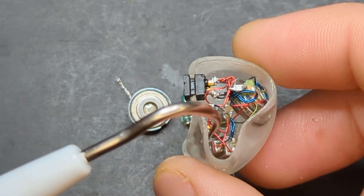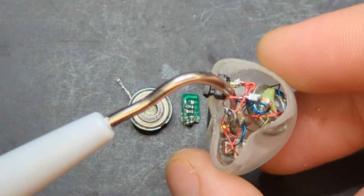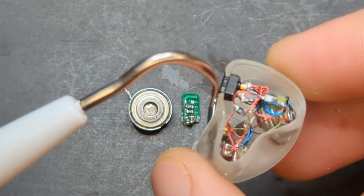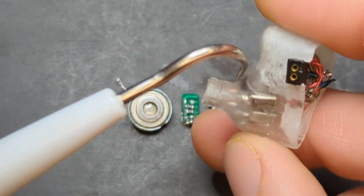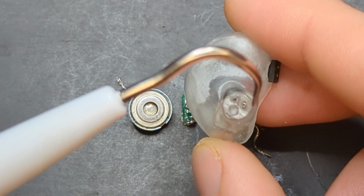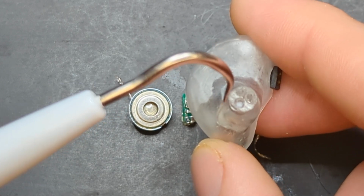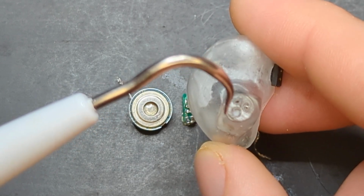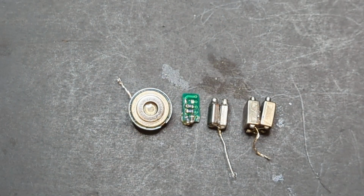All the rest are e-audio. And the reason why is because with the Knowles, there's just no competition. There's no replacement for the treble that these do. And you can even see I'm using no dampening, so there's no dampener for the treble. Only dampening is being done on the mids and the bass driver or the woofer.